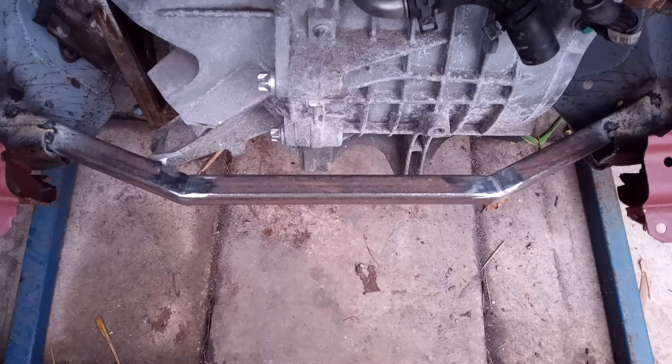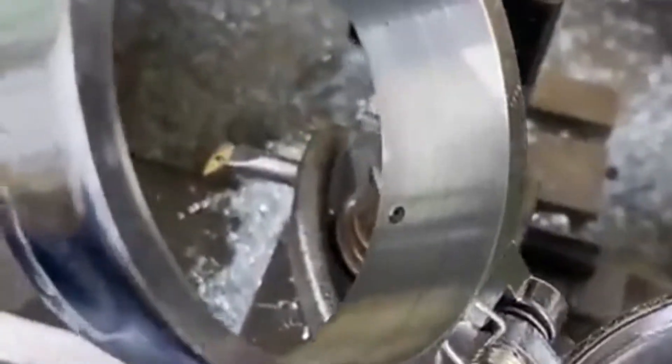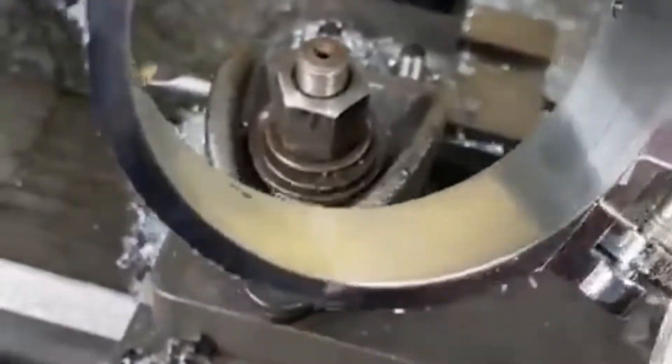This is the cap that I've modified for Scott. It had a smaller bore and I've used the lathe at home to bore it out to the size to fit the EV plug that's going to go in there. Obviously I had to take the springs off and the cap off to put it in the lathe. Now I've reassembled it with it bored out — job done.